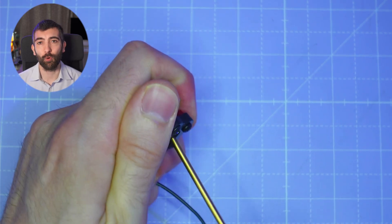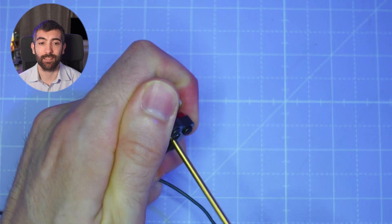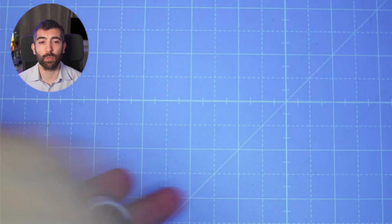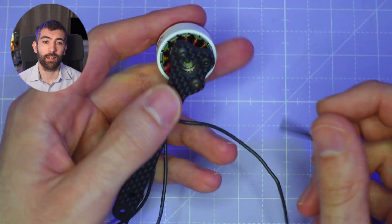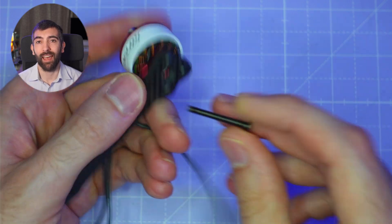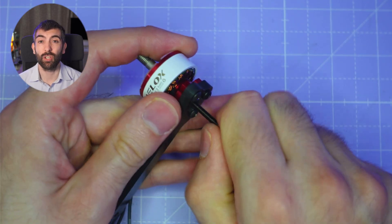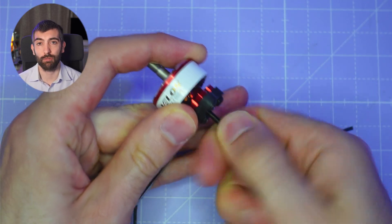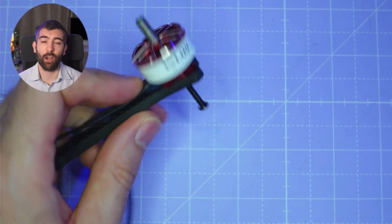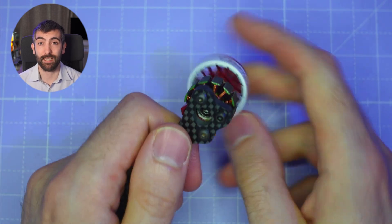The motor has a 4mm shaft with an M3 screw to attach the bell onto the stator — a pretty standard arrangement, and having an M3 screw is good because it's less likely to strip out. If we remove that M3 screw we can start to take the motor apart. The easiest way is to attach the motor to a quadcopter arm, undo the M3 screw, replace it with a long metal screw, then give that longer screw a sharp tap with a hammer to separate the rotor from the stator.